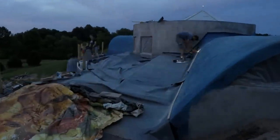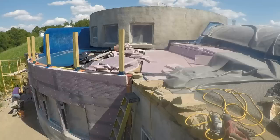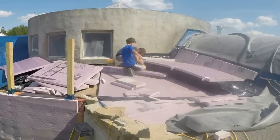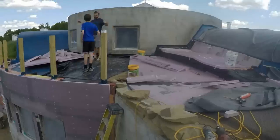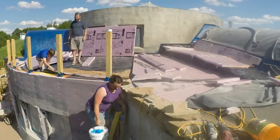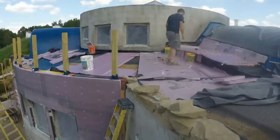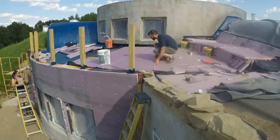The most important part here was screwing down the top edge of that rubber and then waterproofing that edge. Back the next day, the rubber layer is flipped back over that radial vault so we can access the insulation below it, and then I get back to layering up. To save time I try to cut as few sheets as possible — I toss down full rectangles and then cut the triangles that go between them. In this clip you can see Sherry on the left side putting up stucco over the lath from the last video.